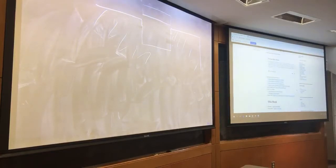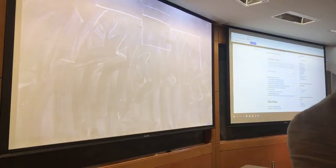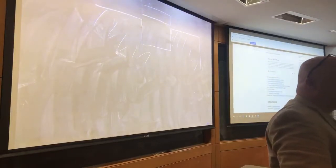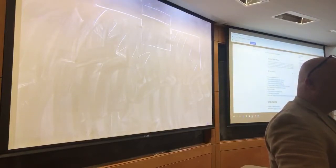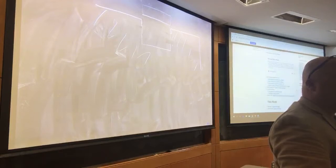What else? What are things we want to be concerned about? Yeah. Design parts to actually work with the machine tools you have, so don't create features that require a 3-axis mill or a 5-axis mill if you don't have that mill. Yeah, I think that was what Wayne was complaining about with his project partner, is we didn't have a machine that was easy to set that part up in. It's also possible that he drew surfaces that it was impossible to reach.